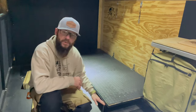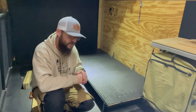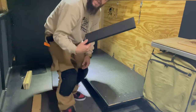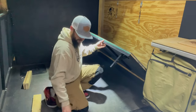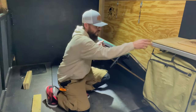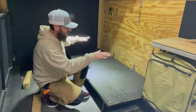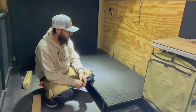As of right now we only have about 7 inches from the bottom of bed to floor, and my objective today is to bring that level up to about 16 inches or so. I'm going to be taking out my hinges and adding on a couple of legs — just 1x4 legs that are going to be screwed right onto the bracket. The brackets I'm using right now are just those shelf brackets that you can screw to the bottom and pop the shelf out. I'm just going to be screwing those 1x4s right to it and adding some legs.